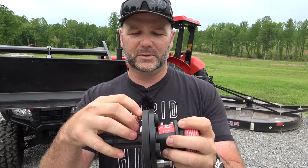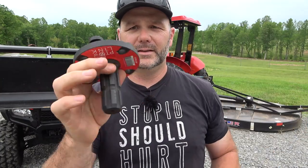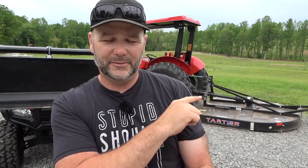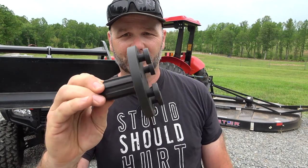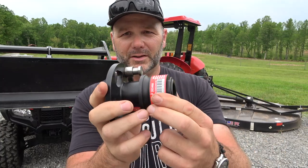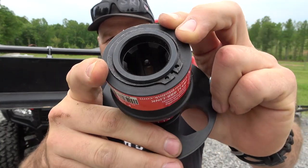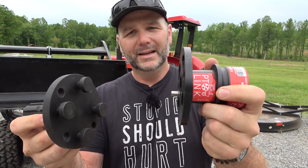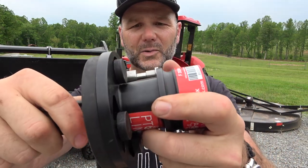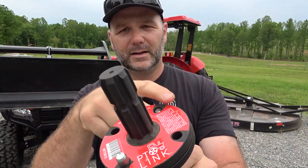Here's how it works — super simple. We're going to show you both ends and then over here on the tractor. You have this male end which goes into the shaft — the shaft that comes off the rotary cutter slips over this and it's permanently affixed to that unit. Then the female end goes on the tractor, butts right up to the rear of the tractor, snaps right into place. You pull this back, just snaps right in — you can see the little ball bearings in there, that's what holds it and locks it in place. This is on your tractor, this is on your implement. Instead of slipping back the collar all the time, all you have to do is put these together, twist it, and it's locked into place. Then push this little pin through the back — so it's double locked.